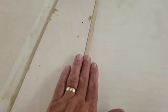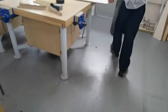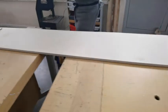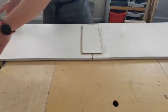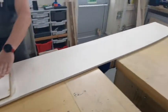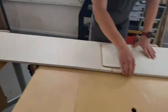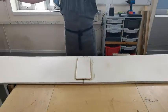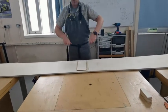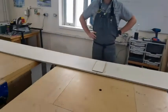So that's gone very well. I did take apart the other two sides earlier on, and we can move across to show you the next stage. These are the two sides now lying on top of each other — exactly the same process took place on these parts and we can see how closely they match. I'm very pleased — they match exactly. I did wonder if there might be a little bit of difference where the joint might have been a slightly different angle, but it turns out to be great. Just a tiny bit of planing to do in the centre to even them up. The next step is to tape and fix the ends, and then stretch it out into a canoe shape — that's probably going to be the next clip.